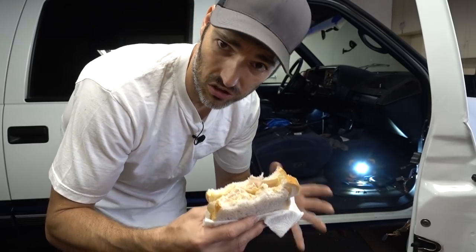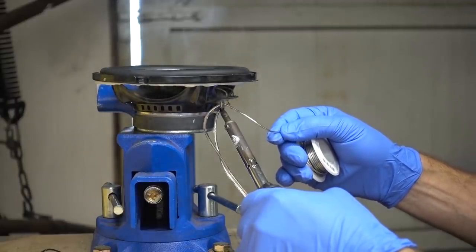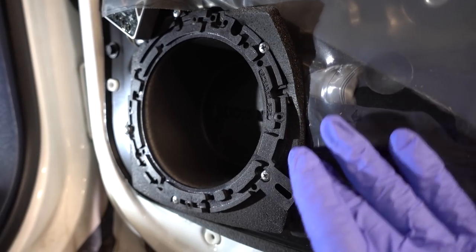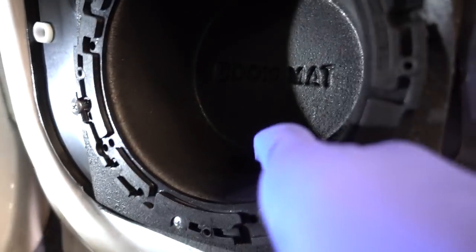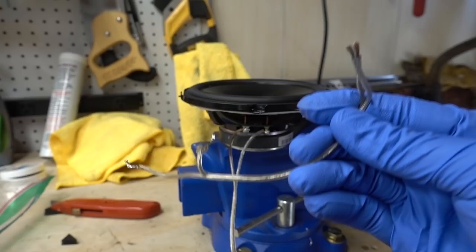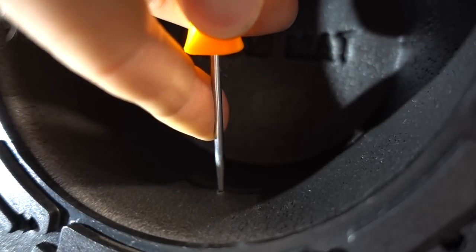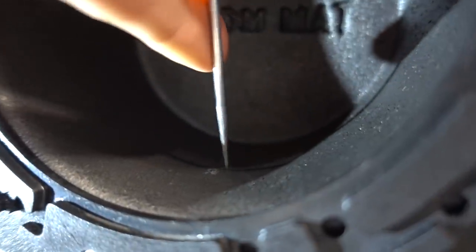Next step is to eat a sourdough turkey sandwich that your wife brings to you. I soldered on some new longer speaker wire, because while I do have to make a hole inside this baffle for the speaker wire to go through, I want to make it at the very bottom. That way, if any water were to get down and drip on this baffle, it'll roll around and drip off of the bottom. If I make a hole anywhere else, there's a possibility for water intrusion. So my hole is going to be in the bottom, which means my speaker wire has to go through the bottom and route back up to this crossover. This old section of wire just wasn't long enough, so I'll put this hole about midway through. There's my hole — just big enough for the speaker wire to go through.